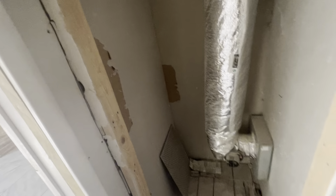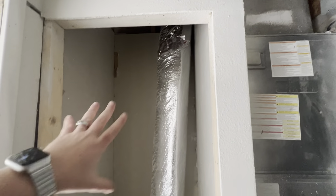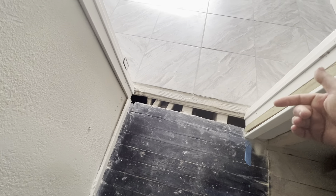There's a chance the water heater — I don't see any plumbing in here, so this isn't going to be a water heater closet. This door needs to be closed off, and there needs to be some sort of ceiling installed in this room as well. This can be fixed with a transition to close up the flooring and put a transition to go from the bedroom to this wood floor.